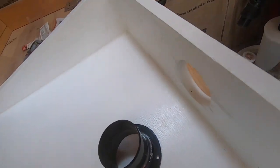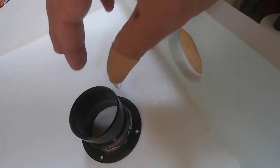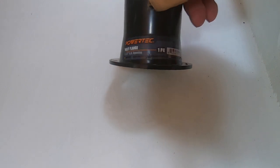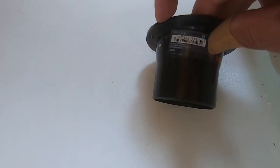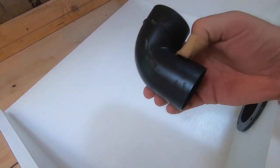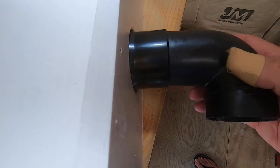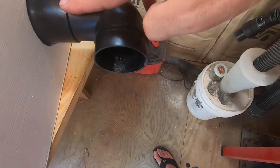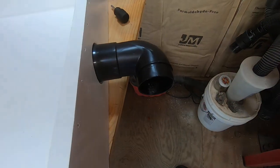Since you're going to need a way to handle dust, we've got our dust port hole cut in the back. I'm using a Powertech brand inlet flange with a 2.5 inch outside opening. It's got a little bit of a taper on it, so I had to taper the edge of my hole a little bit, but it's a nice snug perfect fit. I also have an elbow that slips right in there to give me a nice tight 90-degree turn, because the hose doesn't want to make a tight turn and it was getting pretty cramped in the back.